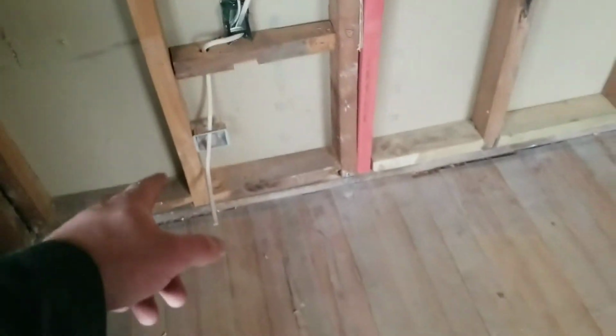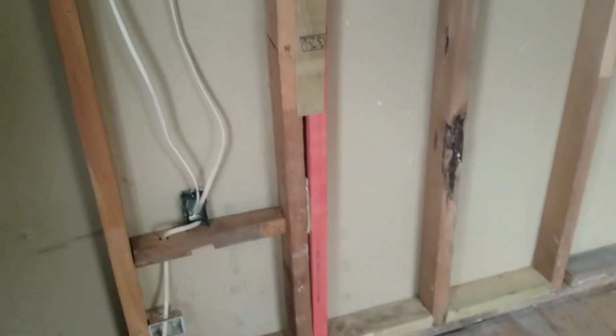So, another few points of notice. I've had to take my computer cable out from the hole in the wall, so that sucks. But we'll leave that one in there because it'll stay behind. That one has a single cable going to it, and 3 to that PowerPoint. So just how it is. Ripped out this piece that was the feed from the old circuit that didn't have an earth with it. And I still got to replace this wire here because it's only a 2-core, and that's going to the light above the computer. So I might even just put another wire in there now and leave a coil up there to deal with that some other time, because that hole's not particularly big.